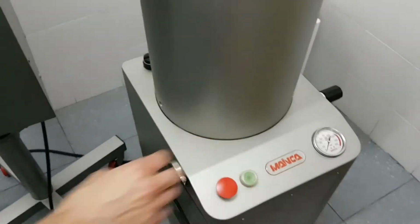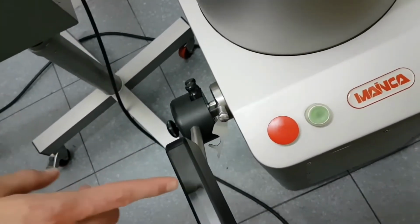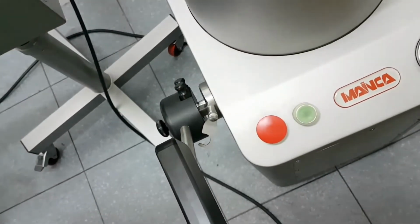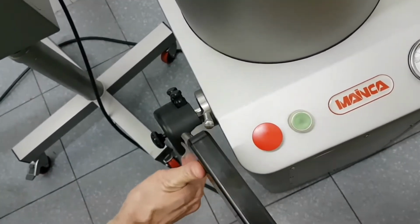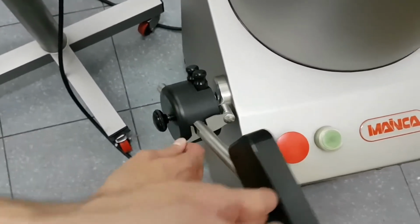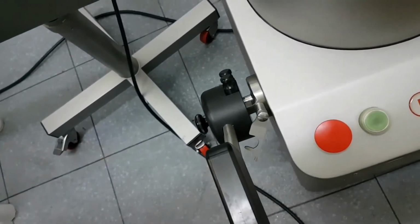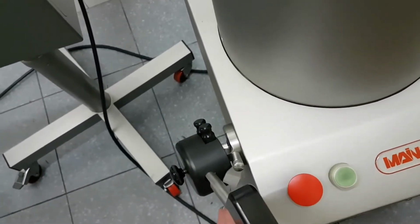So I'm going to switch on the machine. I'm going to lock the knee lever because this machine needs the sausage filler kept the knee lever pressed all the time, because this machine is the one which is feeding the twist linker. But when you stop working, it's important to release the knee lever. Now it's on. When I change the casing or I need to stop for a while, we highly recommend to release the knee lever, okay? So just lock it when running the machine. So now I lock the machine.